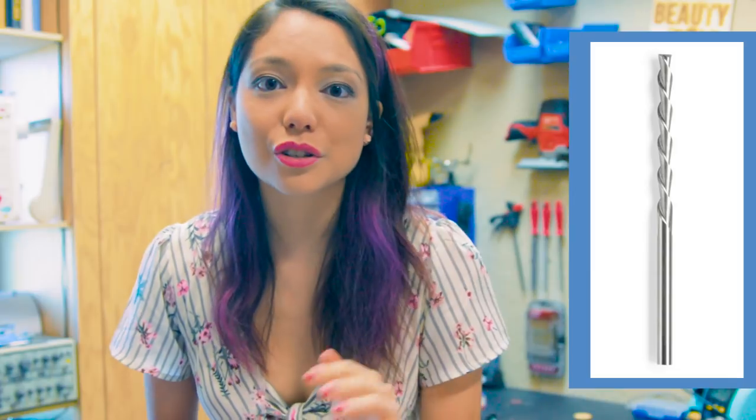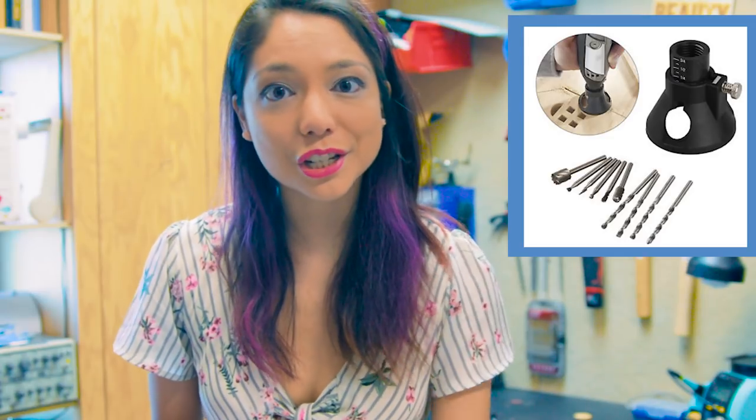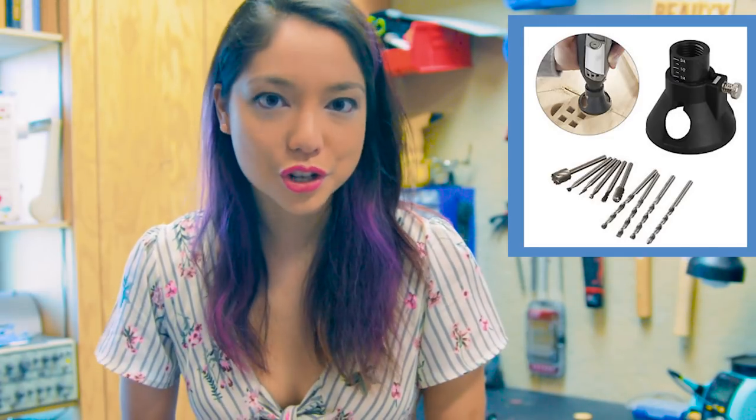Make sure you know that this is very different from drill bits. Drill bits have no lateral strength and should never be used sideways. These are probably the easiest tool to attach because there is only one piece and it just screws into your Dremel. Just make sure to use the right bit for the material that you're cutting. You can also use an attachment that will give you a nice offset from the material and let you route more traditionally. And there's your crash course on cutting things with a rotary tool.